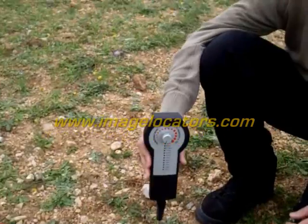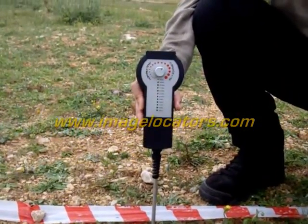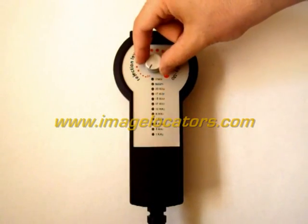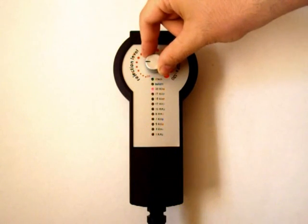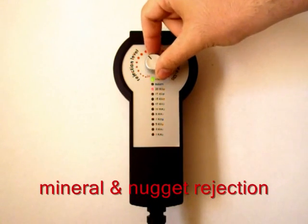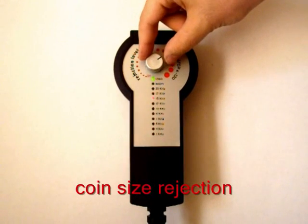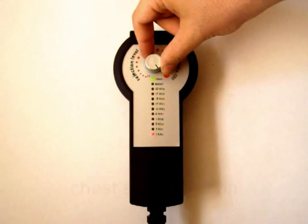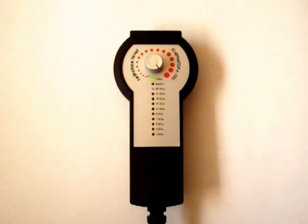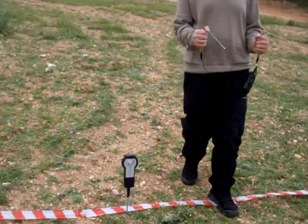Place the optional Eliminator E120 device at the energy line. Walk circles between the Eliminator and the ground probe. Small objects are cancelled with the rejection knob, while larger targets continue to respond. The antennas do not respond anymore, and the energy line of the rejected target disappears.